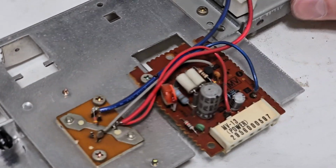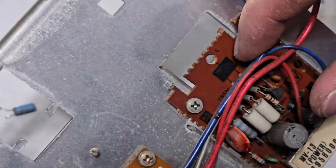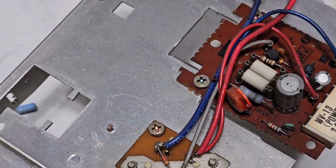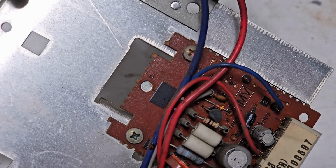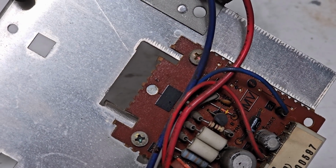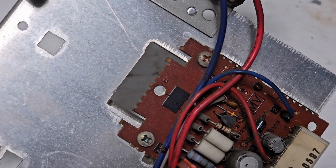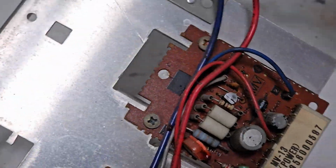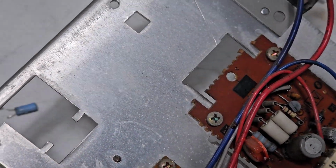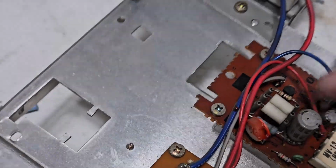Up next, regulator board. I'm wondering if that's a separate regulator for the audio amp section's power supply that's not populated on this board. Some of these have an audio amp still on them. My 4500 still has an audio amp. Yeah, that whole other edge connector on the main board, I think that's for the audio section, and this is also for the audio section. So there's only two capacitors on here for video.